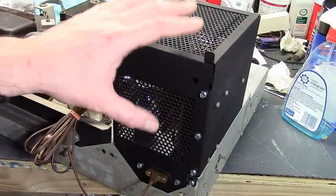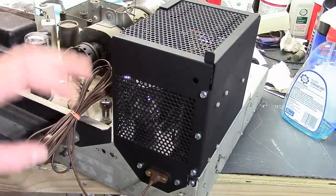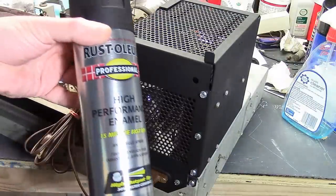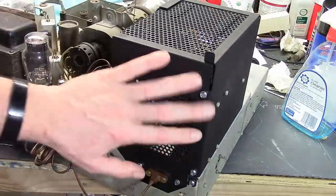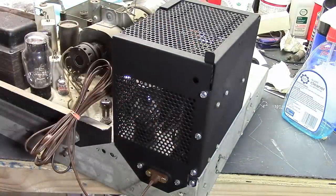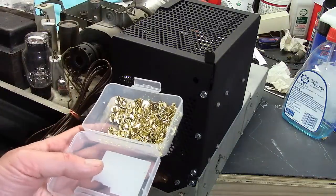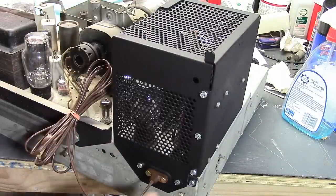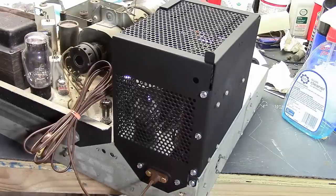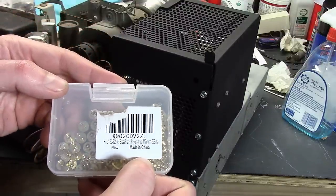I've completely finished up work on the high-voltage box. Everything's been cleaned, new tubes, resistors replaced. Very happy with the way this high-performance flat black enamel worked out — no orange peel, no runs, no peeling. Put in some new sheet metal screws to hold it all together and attached a new power cord. Thank you, Dan Jones, for the suggestion to use binder screws — M5 by 6 millimeter. They're used in leather work or paper crafting, absolutely perfect to hold these on. Originally they were riveted, but these work out great. I'll include a link to where I got these on Amazon.